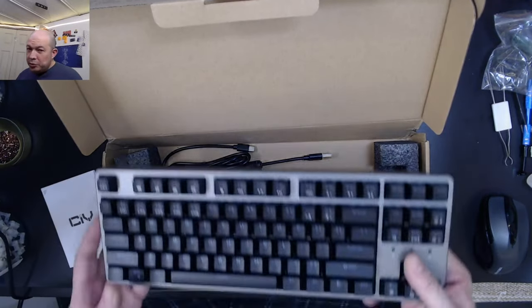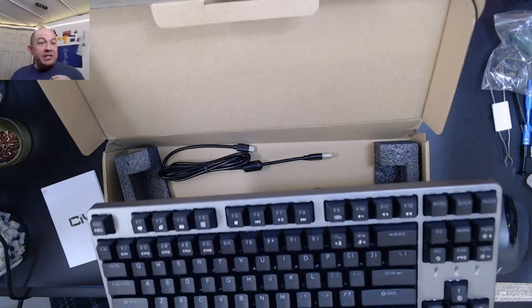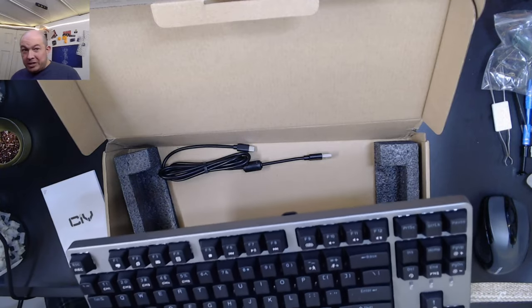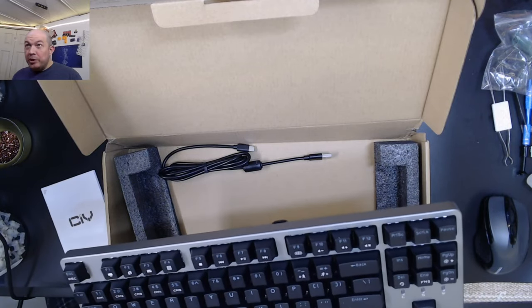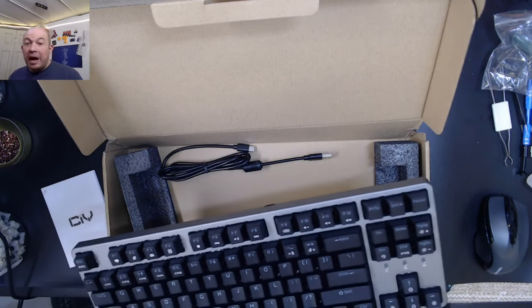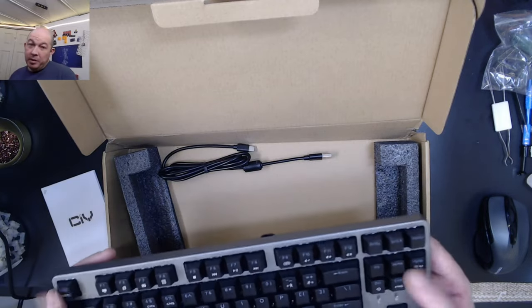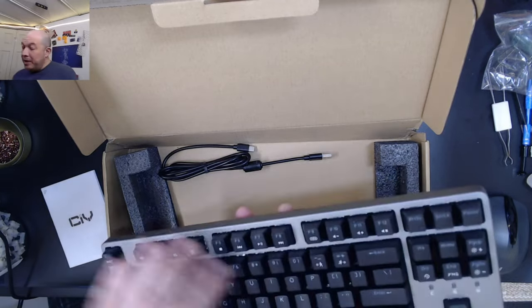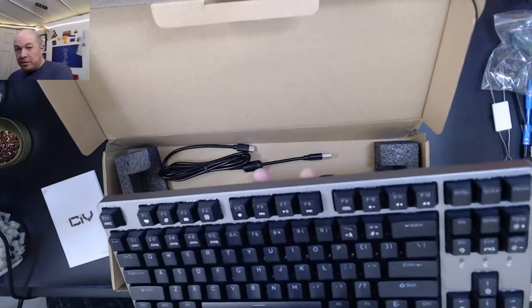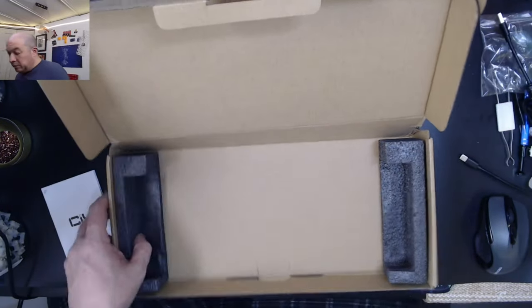Now, just real quick, these boards do have a rebranded Sonix chip, MCU, so there is the possibility of building a QMK loader for this. I have not looked into it. I do want to. I just haven't had the time, but I think it's coming. And you can tell many times by the way that it lights up. If you have a keyboard that lights up kind of like a snake that goes to the center, as you will see when we plug this one in, then most likely you're using one of those.